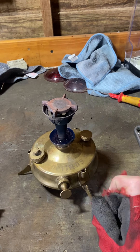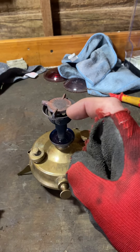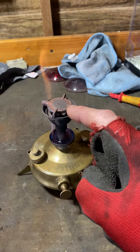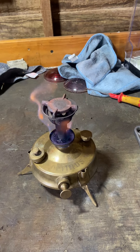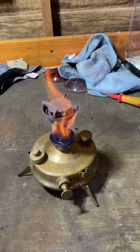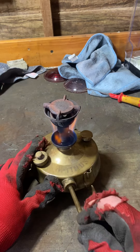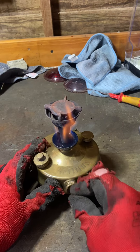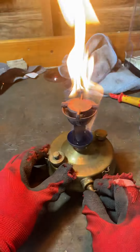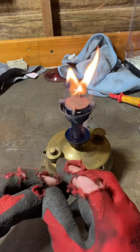Basically what it's going to do now is heat this area up, heat the tube up. Just at the top here is where the fuel comes out — the paraffin comes out — so it'll boil up and bubble up. Then it'll take a second or two just to get heated up, and then we start initiating a few pumps and eventually you'll see the flames.